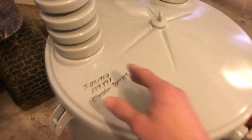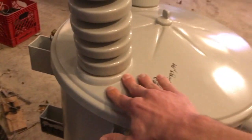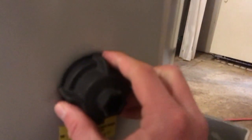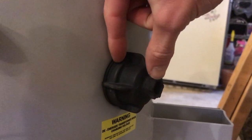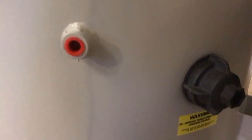I'm thinking it could be on the shanks. These go down into the coil — they have a shank about as equal in length as the bushing itself. Or it could be on the tap changer, because the 22,000 volt components are really only that far away from the case in the oil. If this tank is grounded, I could see that causing an issue. But it really does sound like it's more on this side. Or the only other thing is it really could be the coil.